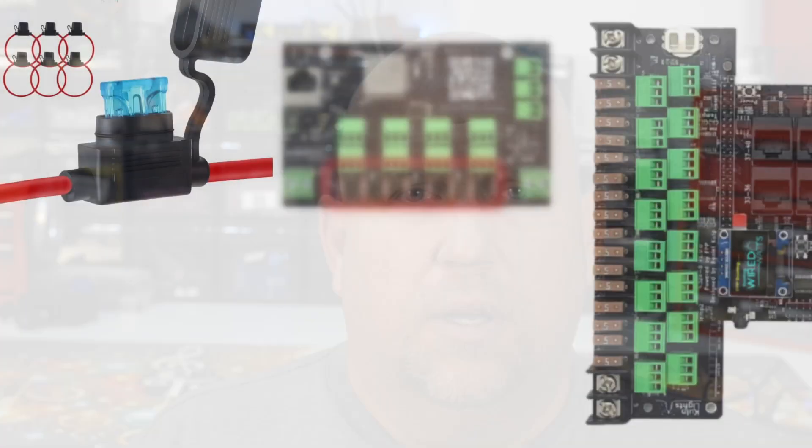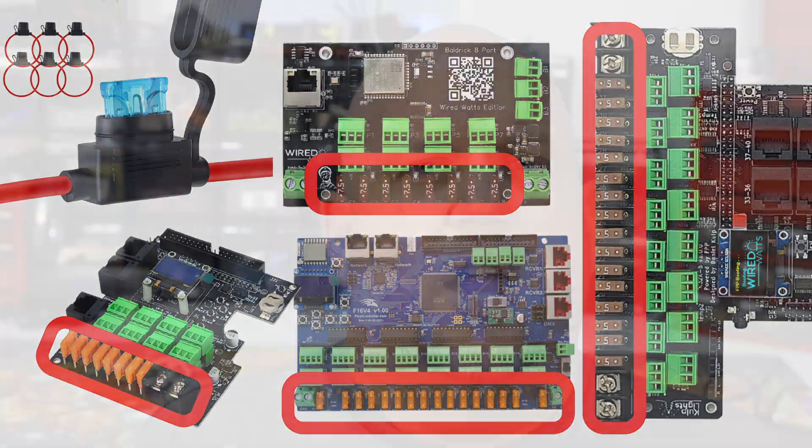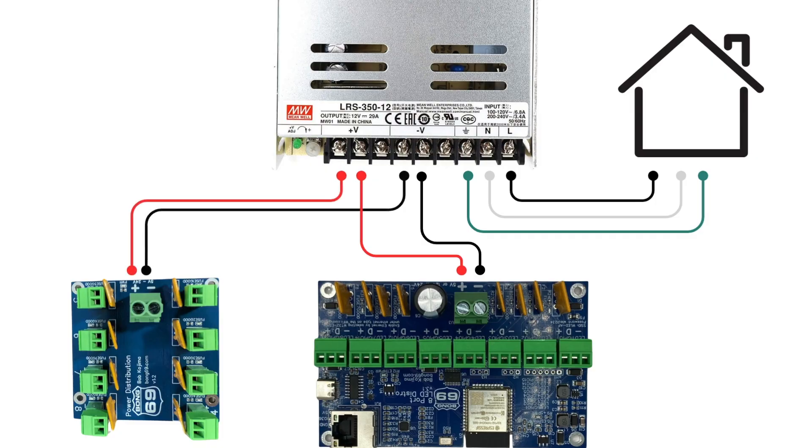Always make sure your power supply is fused. Fuse your power supply — if wires cross you want to pop the fuse, not start fires. When it rains and a bad solder joint shorts out, you want the fuse to blow, not cause a house fire. When wiring it up, connect the positive and negative DC lines from your power supply to your controller. Keep your polarity straight — positives to all positives, negatives to all negatives.